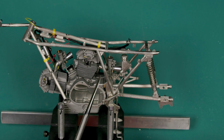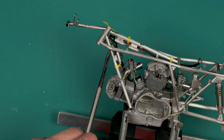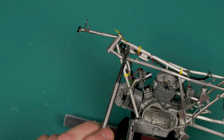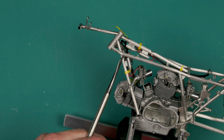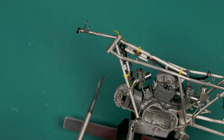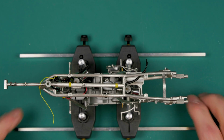Originally it's screwed together. There was screw holes right there, right there. You can kind of see actually after I worked it, I put a brass tube in there, or a copper tube. Brass, probably brass, I can't remember. But I ran a brass tube all the way through, and it was hollow, and then I flared it so it crimped everything together, and then I filled that with solder. So white metal solder doesn't really stick to brass very well, but for a case like this, you can do some filling, and it will fill around the brass pretty good. So anyways, that is that.